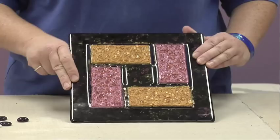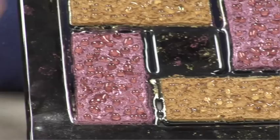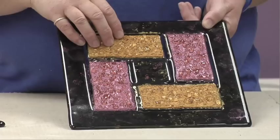As you can see from this piece right here, which is kind of neat looking in and of itself, but not what the artist intended — you can see these holes here. These are between different pieces of glass that didn't fuse together because as they started to get hot, there wasn't a quarter of an inch of glass there, so the glass started to pull together to make a quarter of an inch.